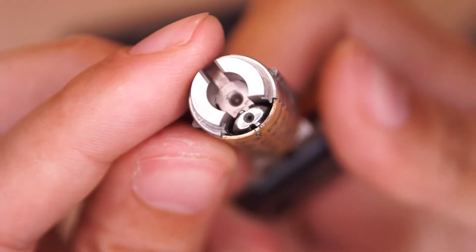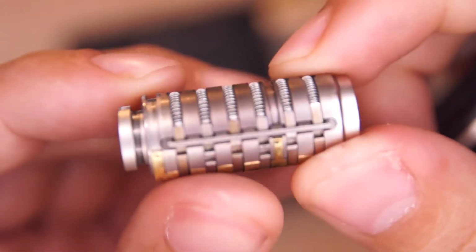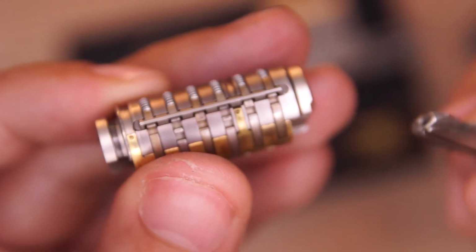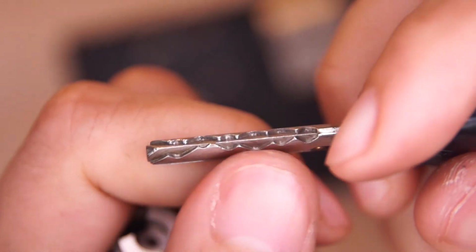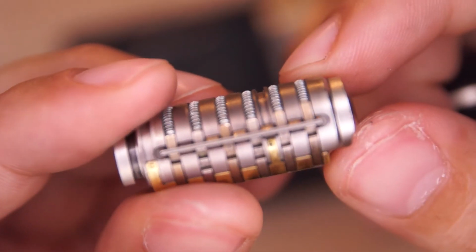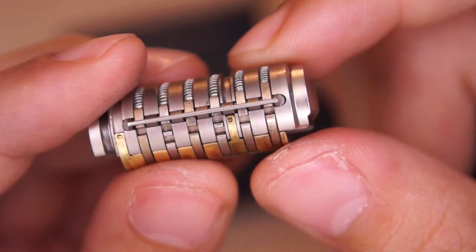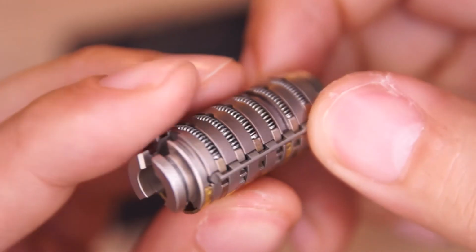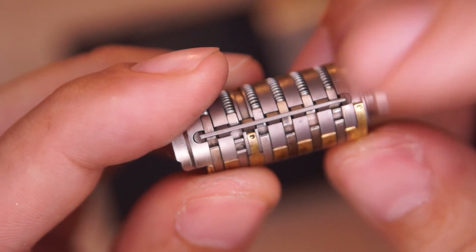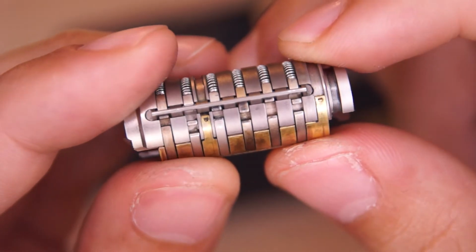Very, very neat design. And of course, this has some similarities to the Urban Alp stealth key system, even if in this case they are curved sliders and not levers, because they are not pivoting around a fixed point. And the bitting of this key is not hidden, but the general shape of the key, of the bitting, and a few parts of the core design are very similar. So I bet that some engineers who invented this beauty were working on the stealth key system as well, or at least they took a few looks at this design. But with some additional false gates, this would really be a way different challenge. It's not easy, but not as difficult as it could be with some smaller improvements.